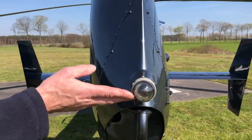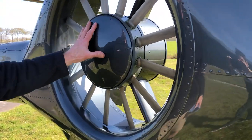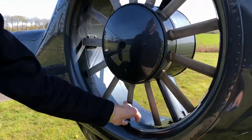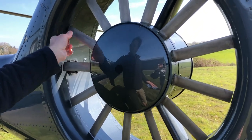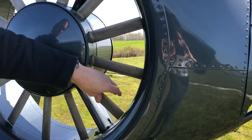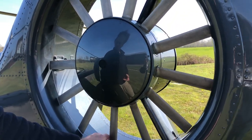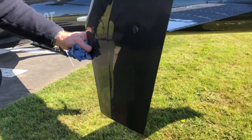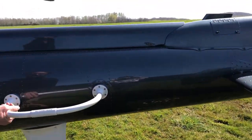All lights, upper lights — everything is attached and secured. Cover is secured. Check all the tail blades; they should sound all the same. It's good to tap each blade so you know if one day it sounds funny or completely different, which means you will have some potential problem. Same thing on the left. Vertical stabilizer — bolt is there. Check securement of the VOR antennas.